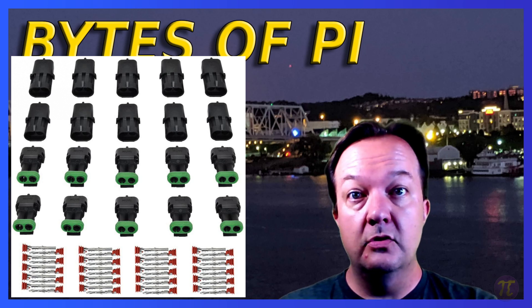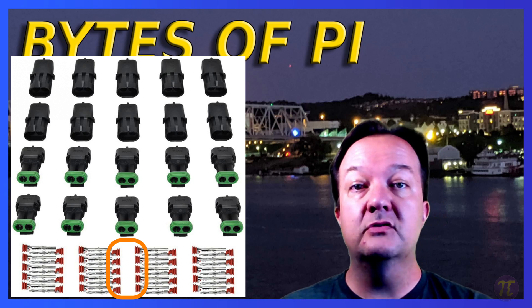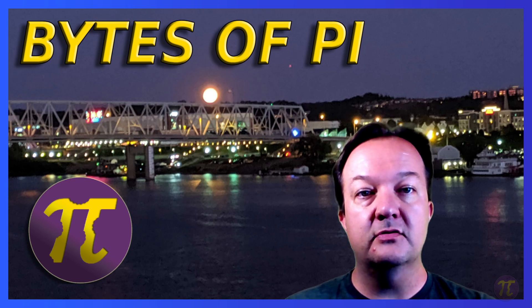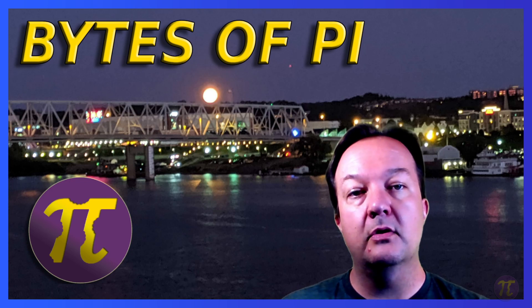For this hobby you'll want to purchase the ones that have the red inserts because they're rated for wire between 14 gauge and 20 gauge. One of the things you'll want to do when you start crimping these connectors onto your wire is to determine whether the male or the female end is closest to the power or data source.